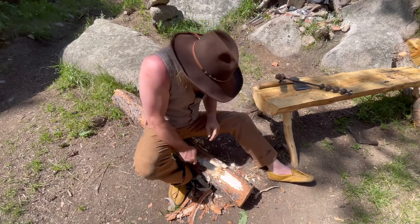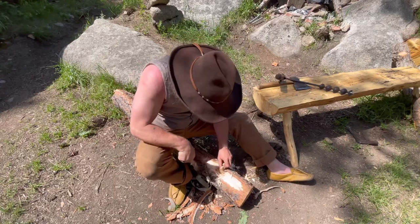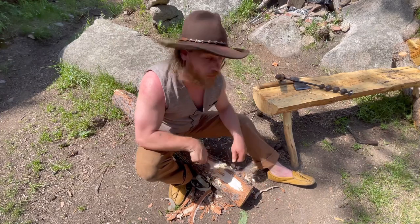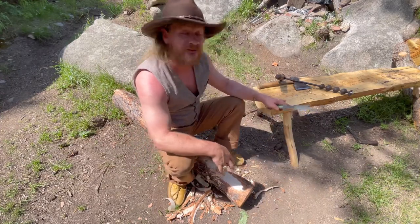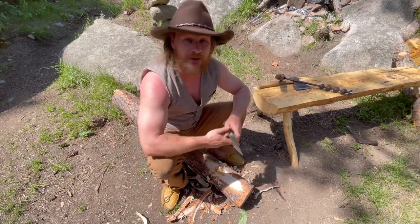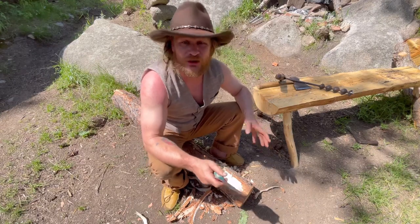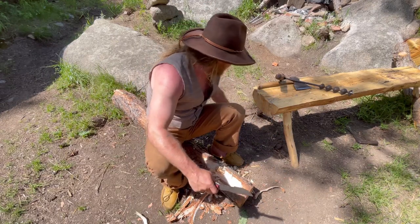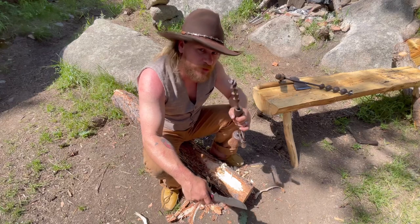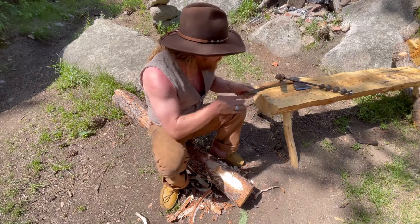You can use your knife to clean up the edges, and down in here there's a nice hole. So if I'm building a bench that's going to have to hold a lot of weight — a few hundred pounds — I'm going to use the bigger auger. That other auger is more if I'm building a structure I want to have around for a long time. Usually the three-quarter-inch auger is all you need for your pins and dowels to hold your wood together. It's really helpful.